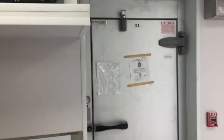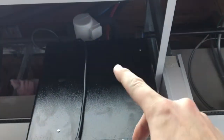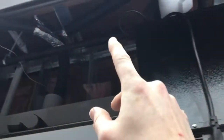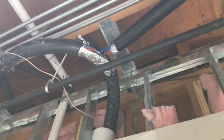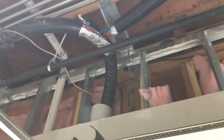We're in the back of the kitchen. There's the keg room that the kegs are in, and here's the glycol power pack. This is a unit that will serve 125 feet of beer line. If you look up, you'll see a blue line and a red line attached to that little foam thing — that's actually a motor that's pumping the liquid contained inside this unit. Currently it's at 55 degrees, going down to 29. It's going into this beer line up here, sending it this way and returning from this way in a complete circuit. It is surrounded by the beer lines in the system, and it is designed to keep the beer that is outside the cooler chilled down to the 29 degrees that this unit is set at. This is a glycol power pack, and that's what it's used for — chilling down the trunk line.